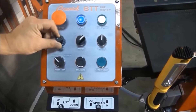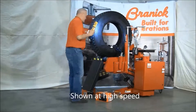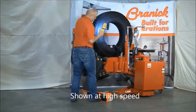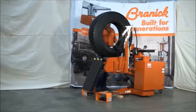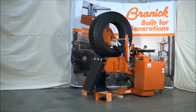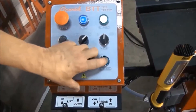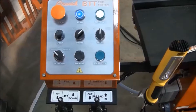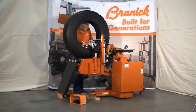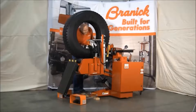Rotation speed can be continuously adjusted to improve the quality and efficiency of your visual inspection. If needed, increase the spread to allow the probe to fit inside the tire, then move the probe in and down. Press the start-stop button to begin testing. When the probe detects a flaw, the flaw light will come on and a spark will be visible at the point of the flaw. The tire will stop rotating to allow the tire to be marked. To continue testing, press the start-stop button again.